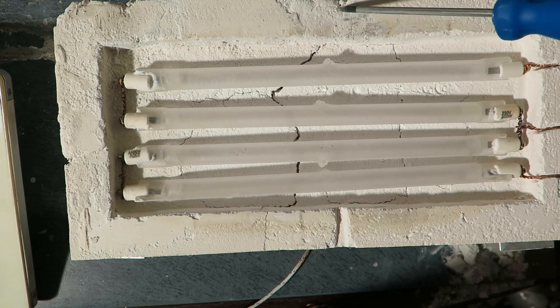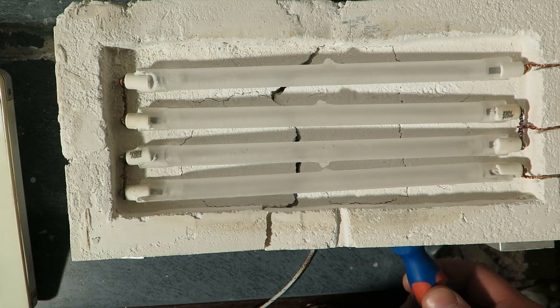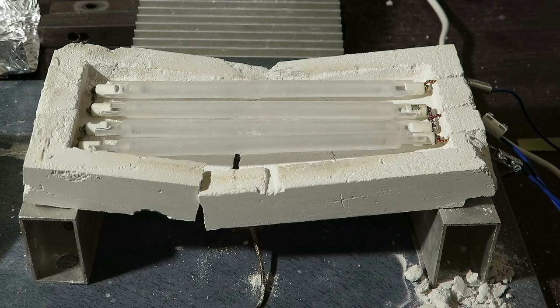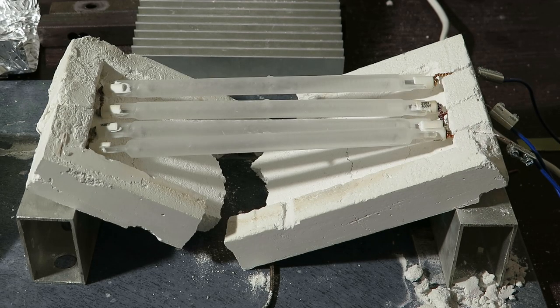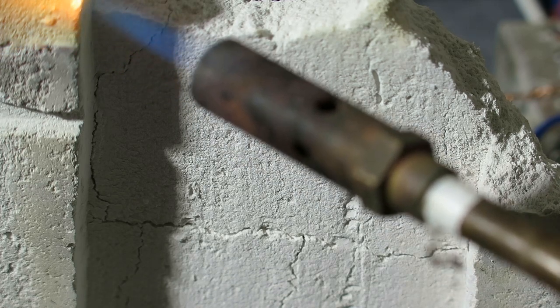What's not so nice is this. This thing wasn't sintered or anything, and the crack looks like it began on the place where it was repaired. The silica gel also wasn't perfectly cured, so this may have an impact on the strength. Anyway, this thing will be enclosed in metal containers, so not a big deal really. But I would really like to improve this cracking issue. This exact piece was really just a proof of concept.